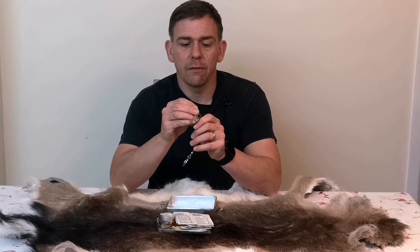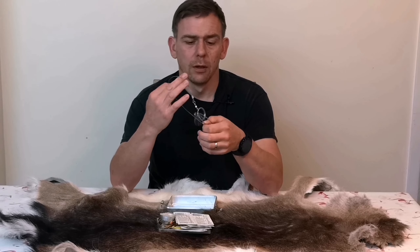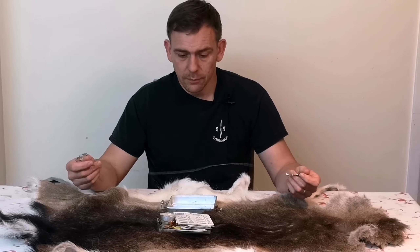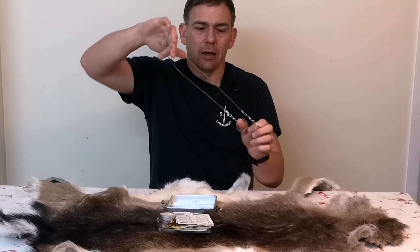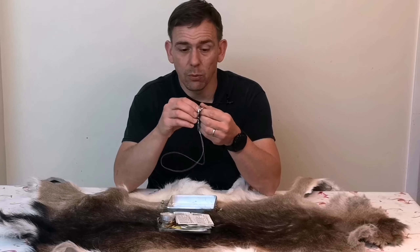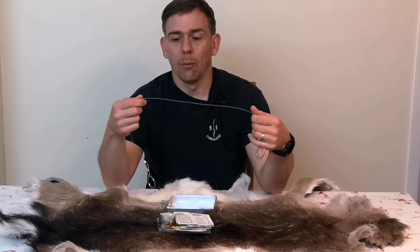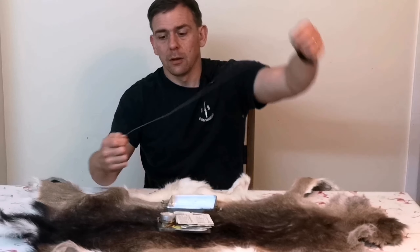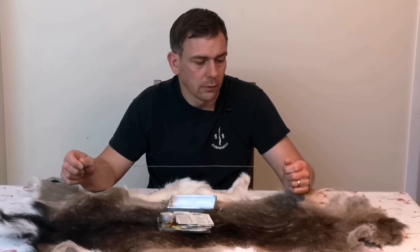It'll be a little bit fiddly to unwind, but that's cool. When you come to use one of these, the tendency is to pull it at an angle, but it just bites into the wood and doesn't really work too well — you can get there but you'll probably end up snapping it. Make sure it doesn't kink because it will snap straight away, and use the full length of the saw, because if you don't, it'll just get hot spots and that's going to break your saw.